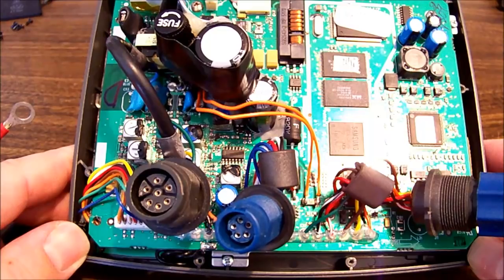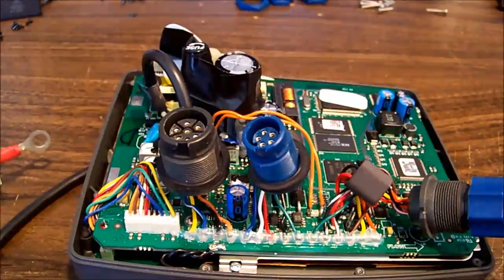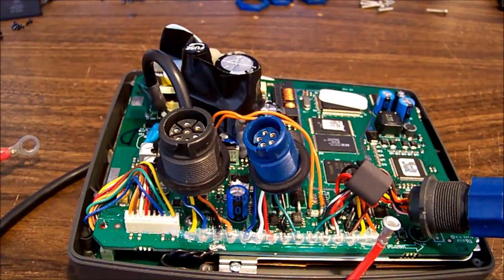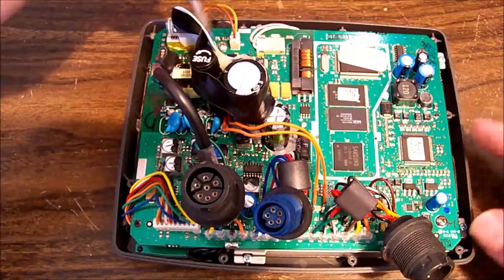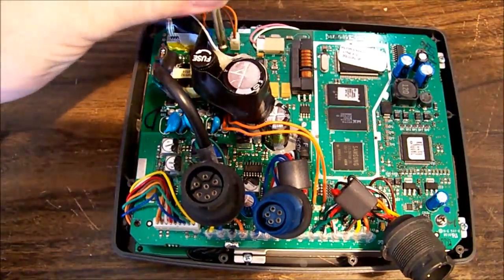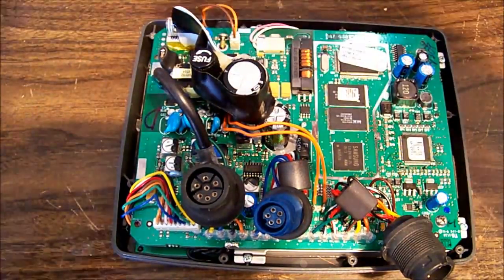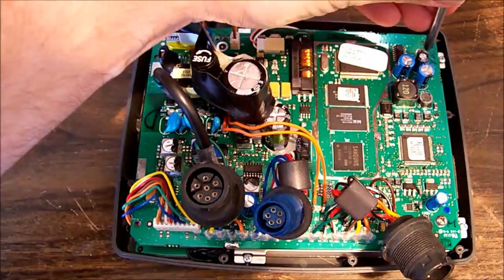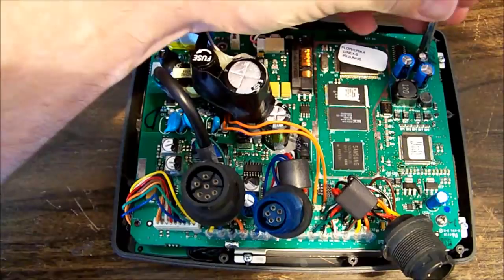we need to keep looking. Something's causing, and it's only causing an overload when power's applied. As I said, I've got a high resistance on the line going in, so we need to trace the circuit through now, find out where that goes to, and find out what's pulling it down. The screws I've used are not magnetic, possibly being marine, maybe they're all stainless steel.